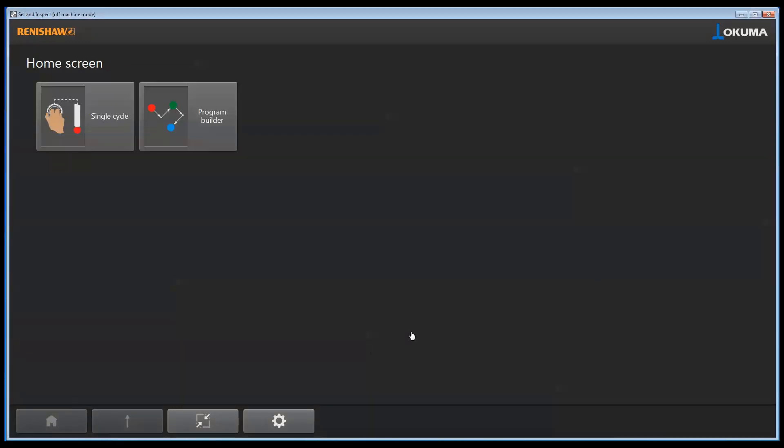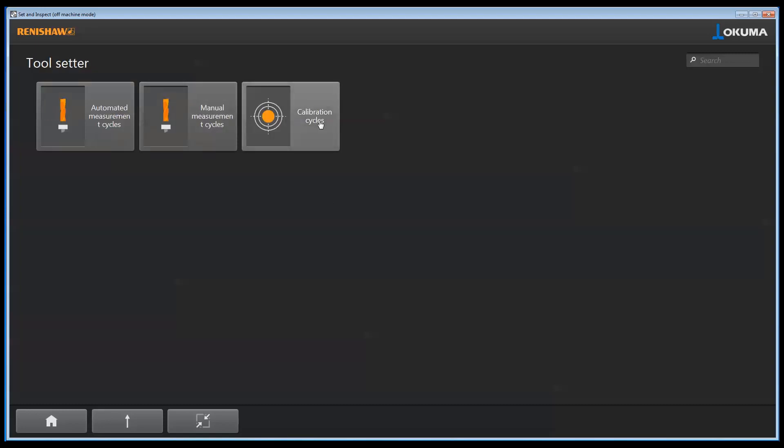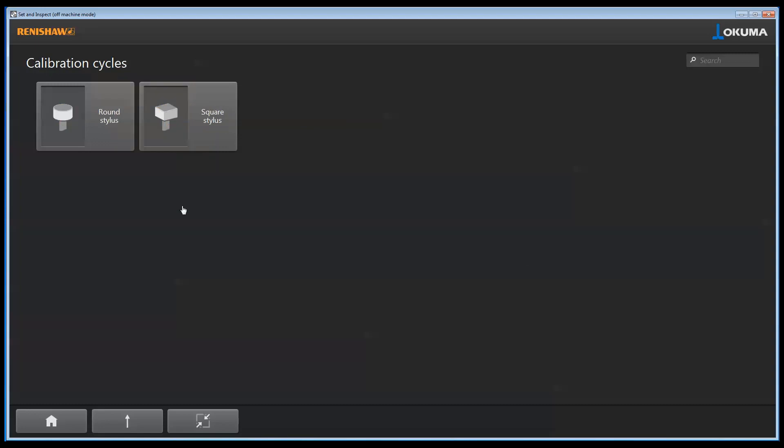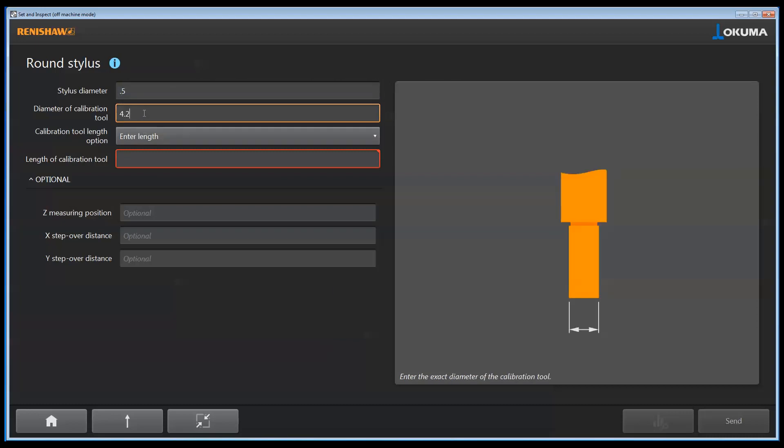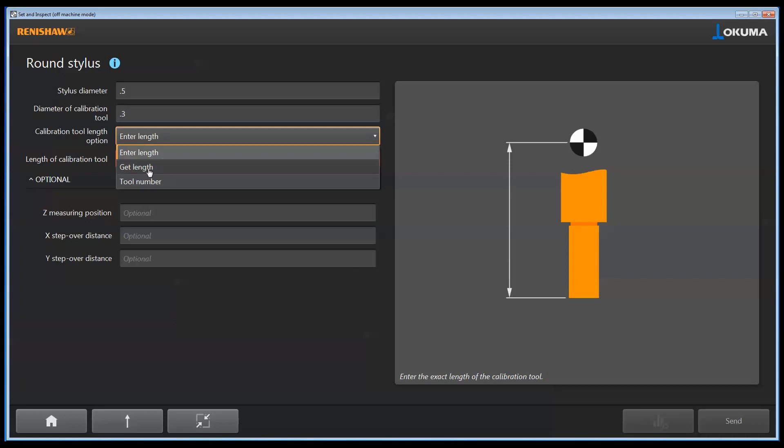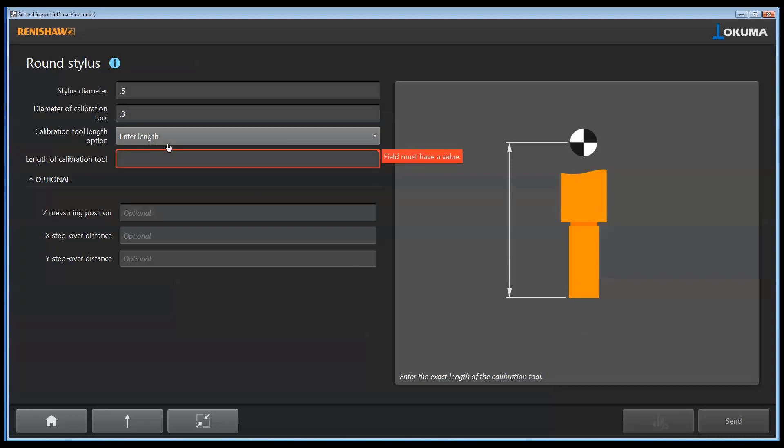I'm going to go back to the home position on our GUI and now mount the calibration standard in the spindle. Hit Single Cycle, express to it that I'm using the tool setter, and I've got a Calibration Cycle button right here on the GUI. I need to pick which type of stylus I have — for my machine it's a round stylus. The stylus diameter, as the picture shows, refers to the actual plunger on the optical tool setter — so minus half inch. The diameter of the calibration tool — notice the graphic changed — minus 300 thousandths. For the Enter Length / Get Length option and tool number, I always leave this on Enter Length even though I went through the process of entering the appropriate tool length offset in the offset table.